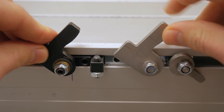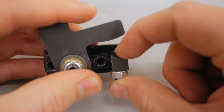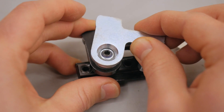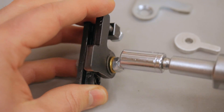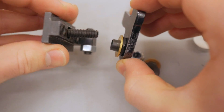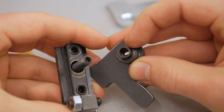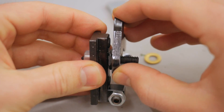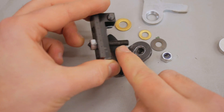It's basically still the same concept and the same idea, but the construction of this one is so much better than the original parts. The end stop is now a screw which can be locked down once you've found the right position — it's no longer a cam lever. The flipping piece, whose biggest problem was that it had play on its screw and just wasn't reliable, is now so much better. This part now has a bushing glued into it, which fits over this screw here. The outer diameter of the bushing fits precisely into this hole, so that flipping piece has pretty much no play at all. This screw is also locked in place and can't move.